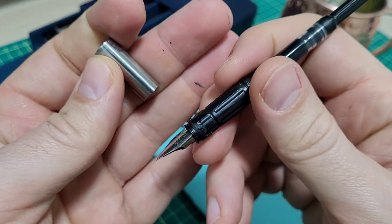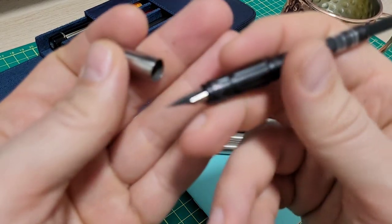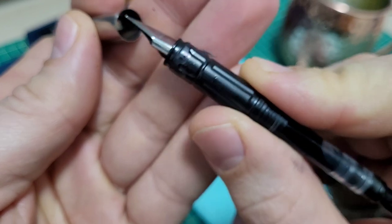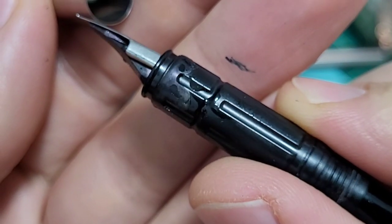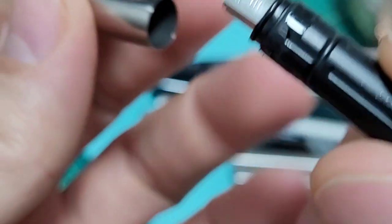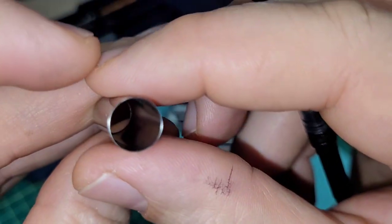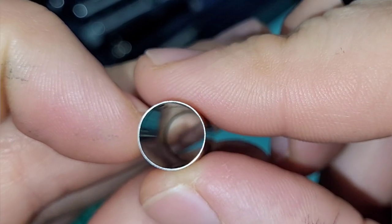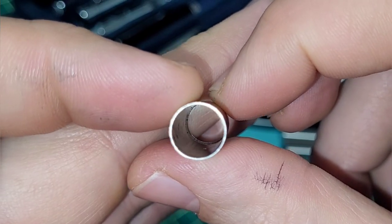I had it when the one good feature of this pen — which was this beautiful little slip cap — stopped working and the section came off. Then I got to look, and they just didn't care at all about assembling this. It just looks like basic super glue on there, and you're going to glue onto this shiny stainless steel tube. There's no surface preparation whatsoever — you can see nothing's bonding, it's totally smooth. This is not going to grab and bite.